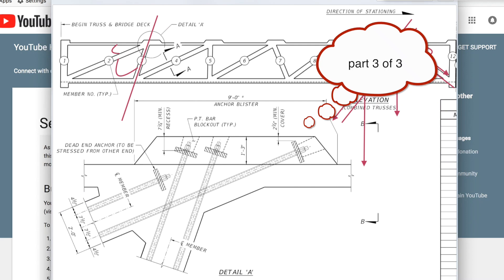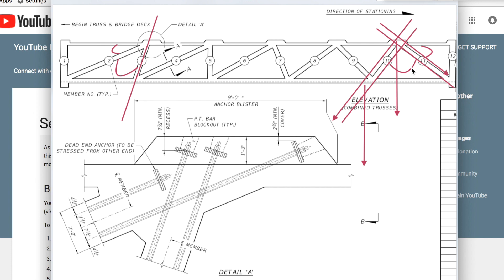I put this in the previous video — this member is loaded at 389 kips, more kips than anything yet. It's supposed to be in tension, so now by default you've made it a compressive member, counteracting your own tension forces. That puts both members 11 and 10 in compression — member 11 forces going down the pylon, and member 10 forces out here at the bottom deck.